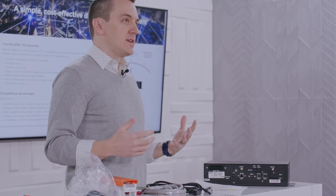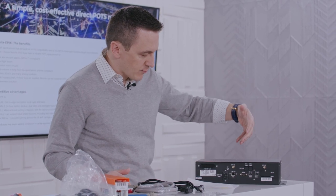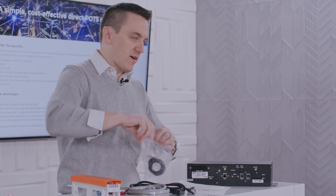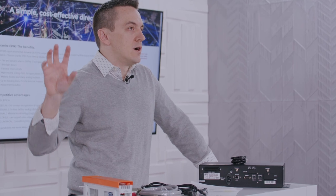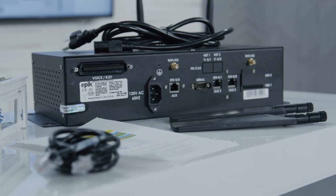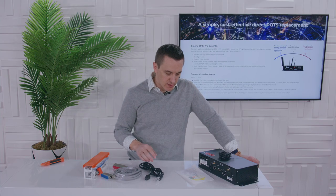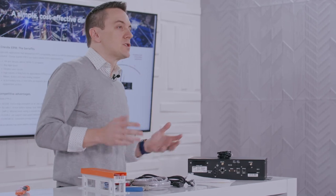Then we've got to test it — that's what the technician will do. They'll make sure they can get to speedtest.net. We can get our WAN ports or LAN ports, anything necessary to get plugged in — all coordinated via the RJ45 in here. Then they're going to test those phones — alarm lines, fax, analog, whatever they are — just to make sure they still work in the same capacity as before. Get the internet connections cross-connected, all the POTS lines tagged and located. And the last part is they've got to send photos back to make sure the installation meets Granite's expectations.